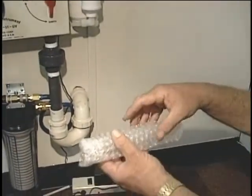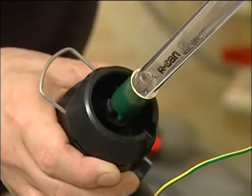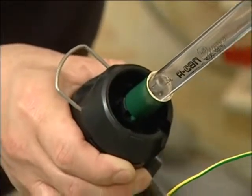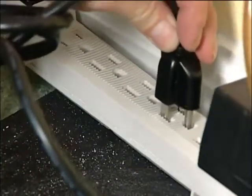The new stainless steel ultraviolet system lamp is packed carefully. Do not touch the glass part of the lamp with your hands. Connect the ultraviolet transformer to the receptacle part of the lamp and insert the lamp carefully into the top part of the housing, then plug the transformer into the surge protector.